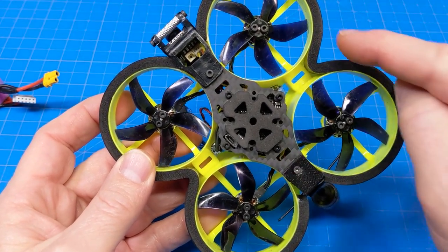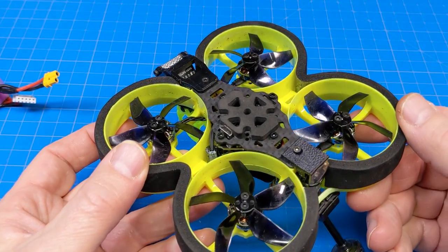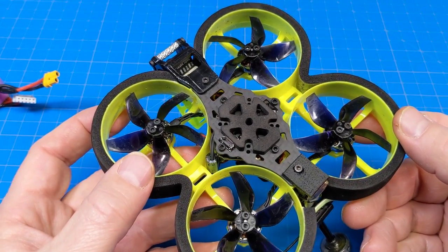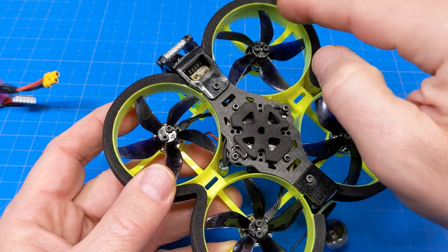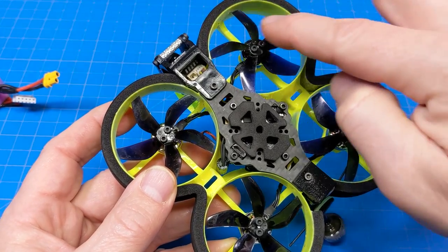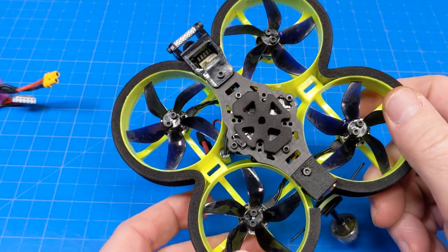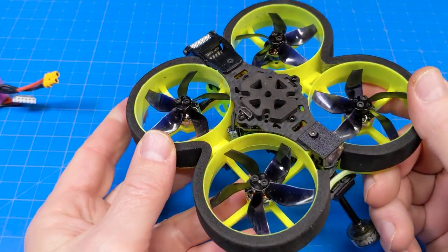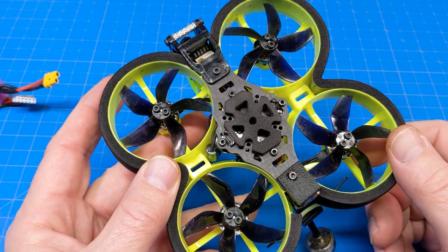Click Save and Reboot in Betaflight. The final step is changing your props physically. The high side of the prop should lead into the rotation. Props only go right side up — they only create thrust one way. Make sure the leading edge is rotating first, for each motor front and rear, matching the props-out configuration.